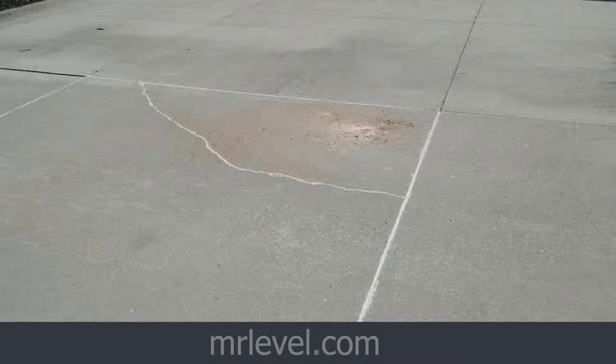In this situation here, the concrete actually cracked, but it didn't settle. So we went in and void filled, and then the customer afterwards went ahead and caulked the seam to make sure that the water doesn't get in there anymore. So when you hear that void, if you don't get it taken care of early enough, it can lead to things like cracks and concrete settling.